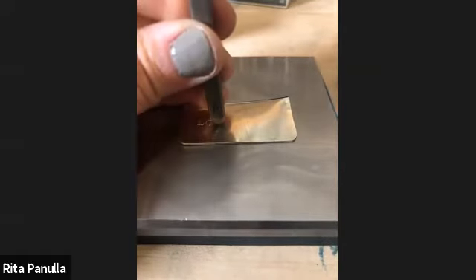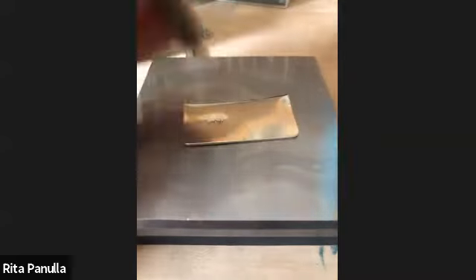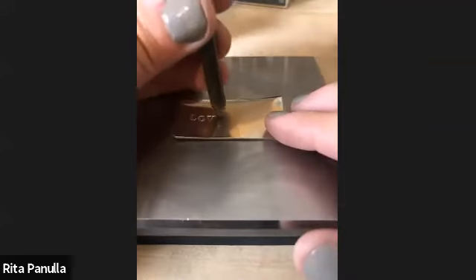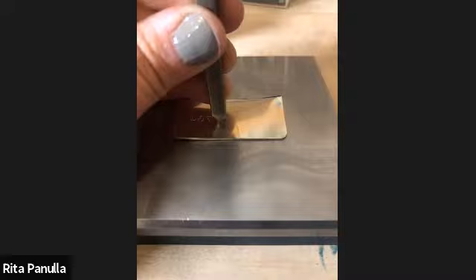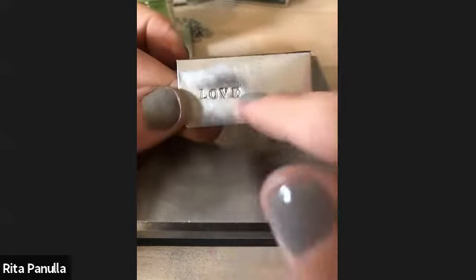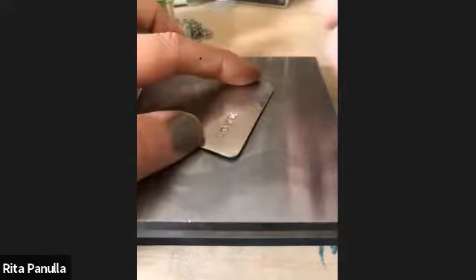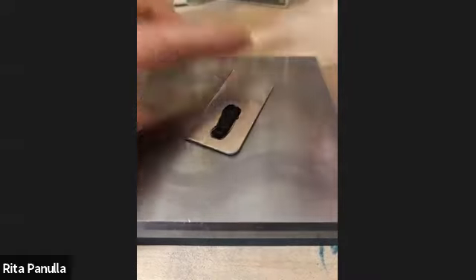Then take another letter and give it a hard, heavy hit. And with my next letter, I'm going to go a little bit heavier than that — I'm going to be aggressive with it. We could all get aggressive, ladies and gentlemen. And I'm really going to over-hit it. So this is a little exercise to see how your font looks when you're hitting it at different forces — slightly different depending on what muscle you use in your swing.